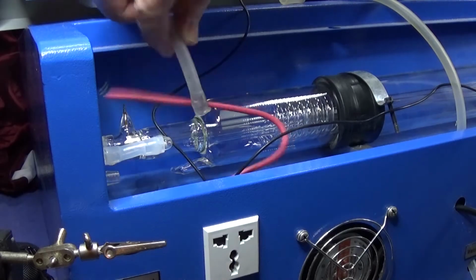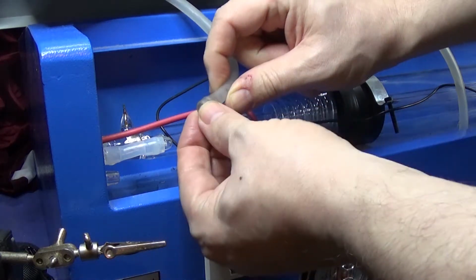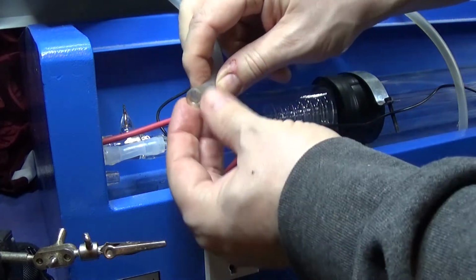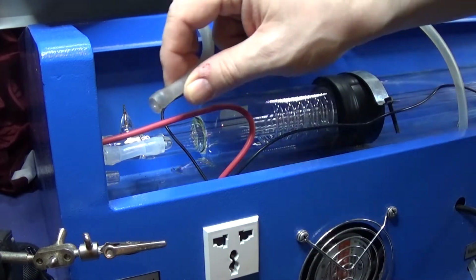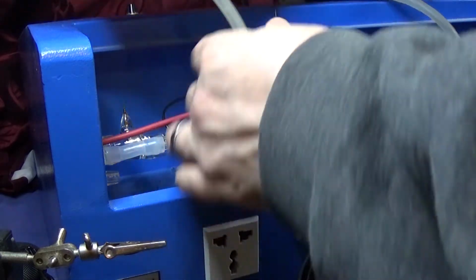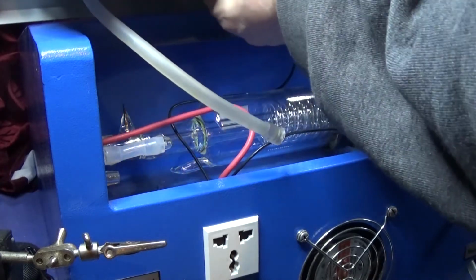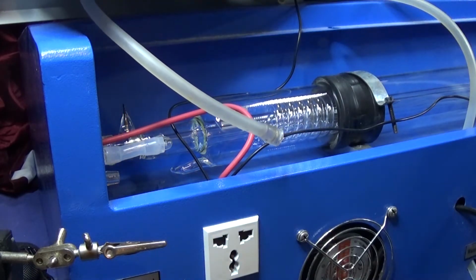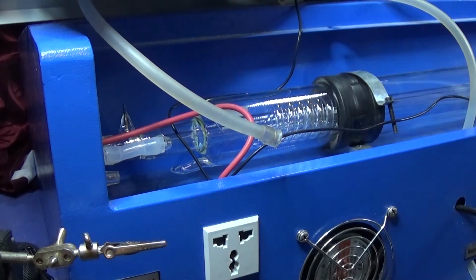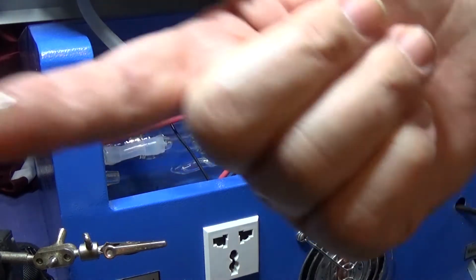Right, I'd like to now connect the tubes. And obviously you saw me taking them off. I had to pick them off quite hard, right? You want to use some sort of lubricant to get them on, but because these are silicone tubing, you want to make sure it is not anything that's going to break down the silicone over time. My advice to you is use dish soap of some kind, and that's even too much, to be honest.